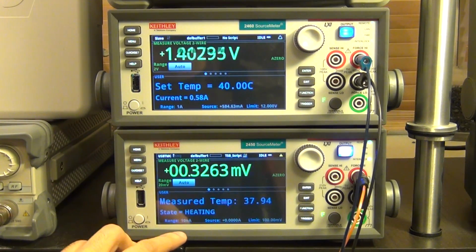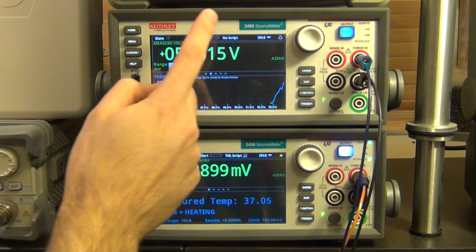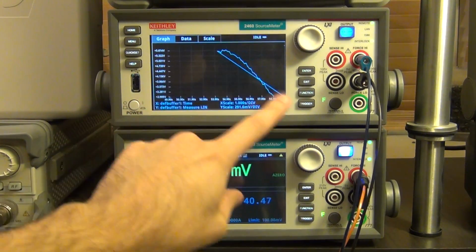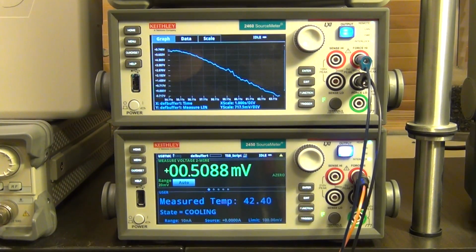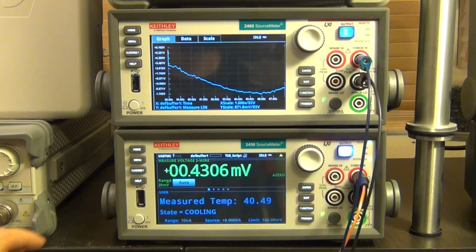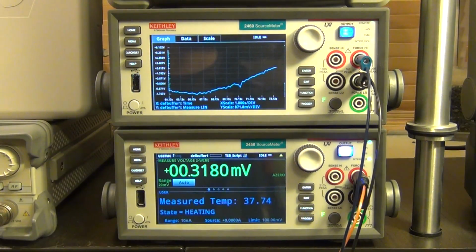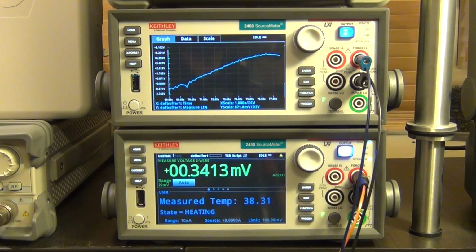And it's going to do this a couple of times until it cools down, and I can go ahead and again look at the curve. It does a little bit of a strange thing sometimes. It draws this line across, which I'm not 100% sure why it does that, but it goes away after some time. I think this might be a minor bug in the drawing algorithm there, but I'm sure they'll fix that. You can see it is recovering back up, and then eventually it's going to come back down. So this curve is the second order time constant of the PID controller's response. It's a very, very common thing to happen if you don't design it carefully.